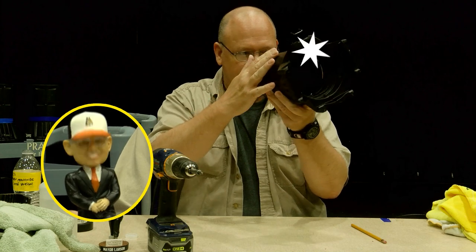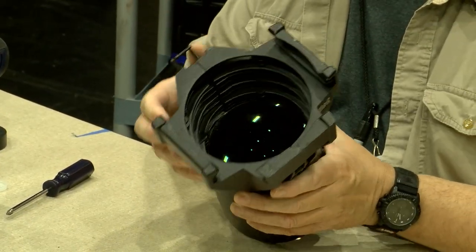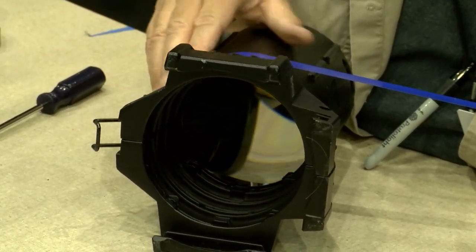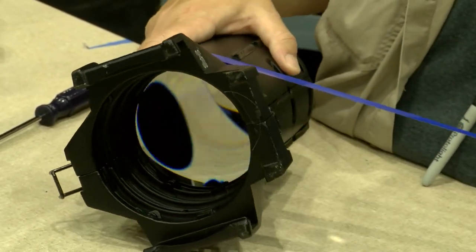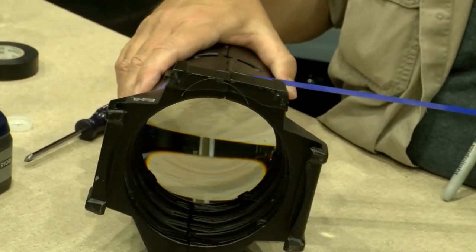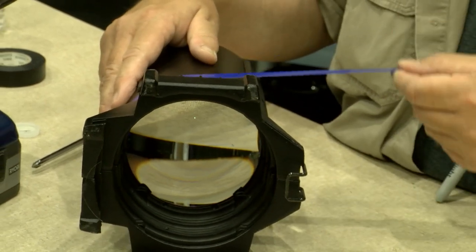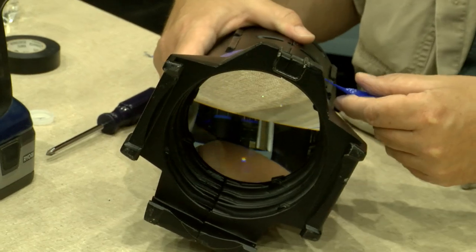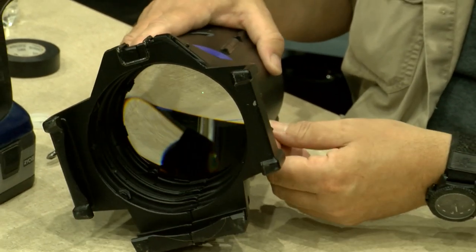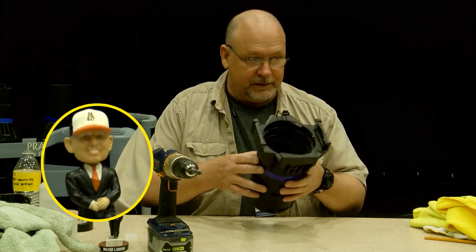Give it another look — it's looking good, looks brand new, we love it. Once you're finished, just make sure that it still works nicely. And if you color code your tubes, put your tape back on. You're probably asking why did you leave the tape on before but not just tape it together right away to hold it while putting the bolts in? That's a good question. But if you do, generally the tape is going to get pinched at some point, and it might be at a point where it impedes your lens tube from going in the barrel properly. You want to keep that nice and flat. There you have it — it's done, it's clean, on to the next one.